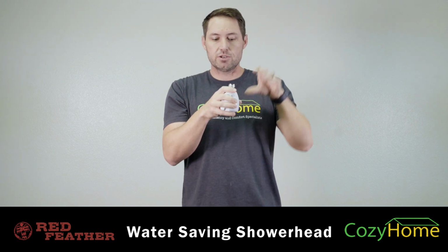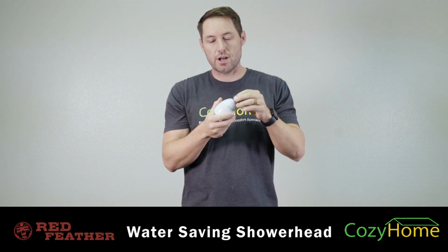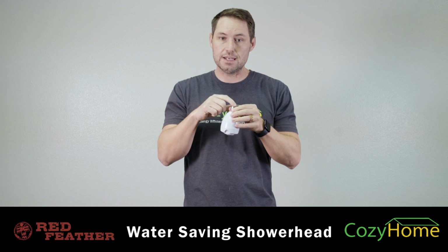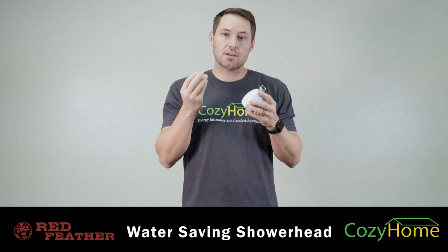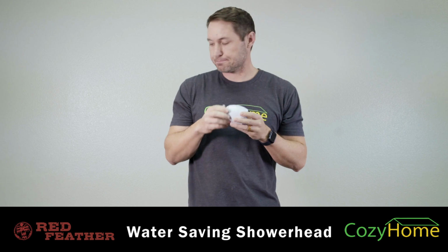So make sure you grab the neck of the shower head, take a wrench or a pliers to get this off. Once you get it off, you can just screw the new one on. And it has a little rubber gasket in here, so that helps to make a tight seal so it doesn't leak around here. But if it does leak around there, you also have in your kit some Teflon tape that will help seal that up so that you don't have those drips and stuff.